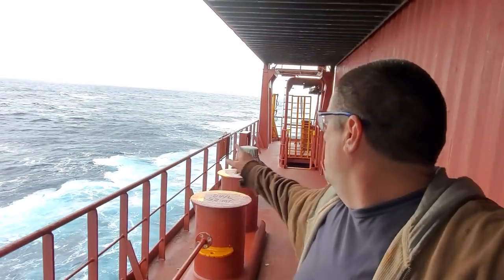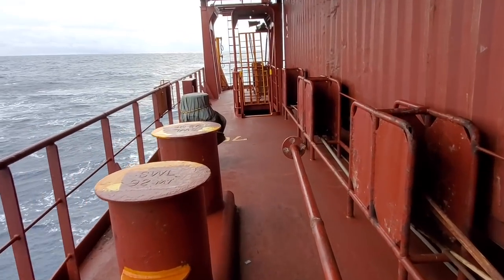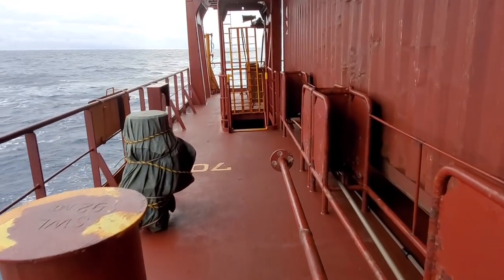I've got the pipe right here. Just behind me is a stairway that goes down to the stern where the mooring winches are. The pipe is a little long for the shop, and other people are working in there, so I'm going to try to do the repair on the stern. I'll clean up the patched section, see how big the hole is, and determine how much I need to cut out. For now, sliding it down the stairway and securing it for the night.